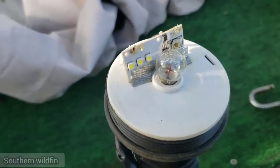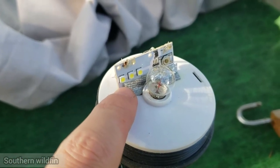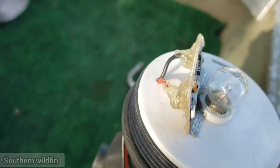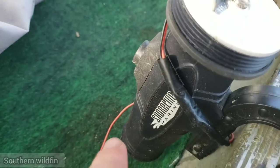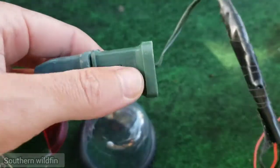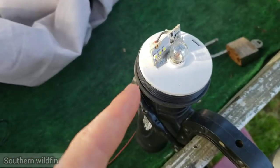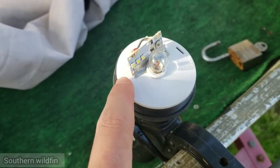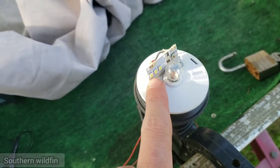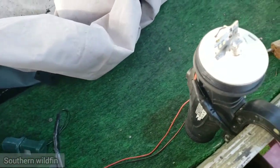What I did was I left the original bulb in it but I don't use that. This piece came out of a dollar headlamp at Walmart. All I did was take it and mount it on there, run some wires through there. The wires go all the way down to one of my little Christmas light plugs, which has got a fuse in there. Then, because the 6-volt was too much, I put a resistor on it to resist the current coming from the 6-volt battery so it wouldn't burn out these three little LEDs. That's how I did that — pretty simple, easy, wasn't hard at all.